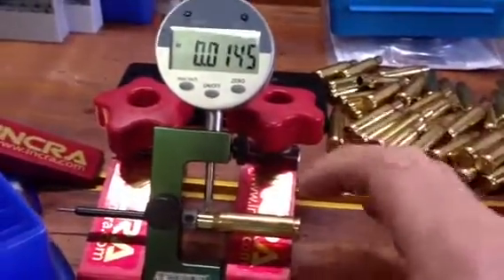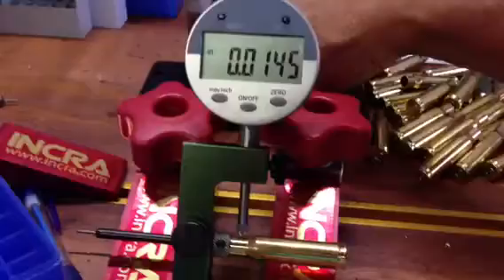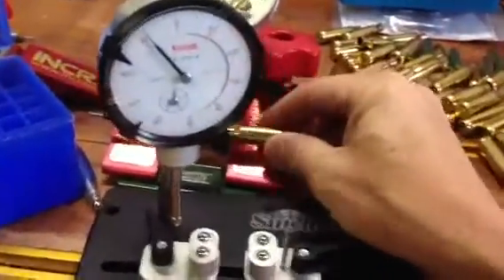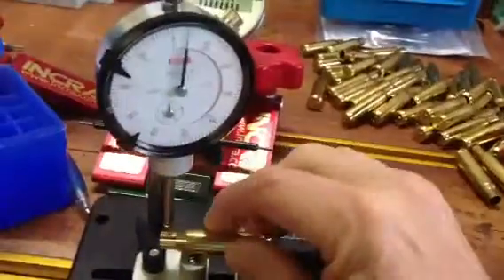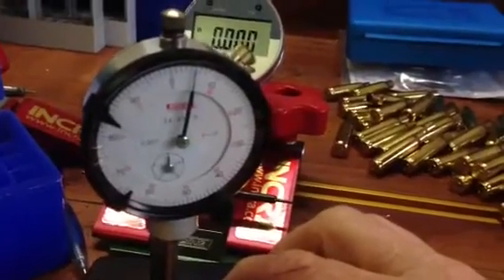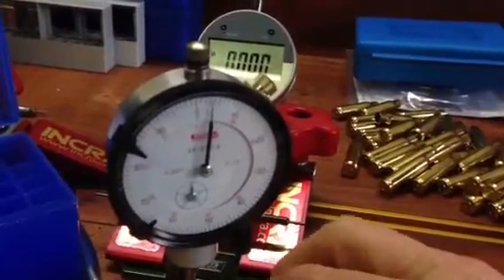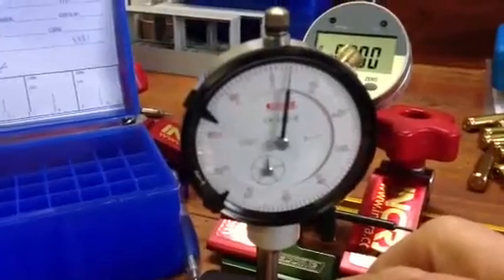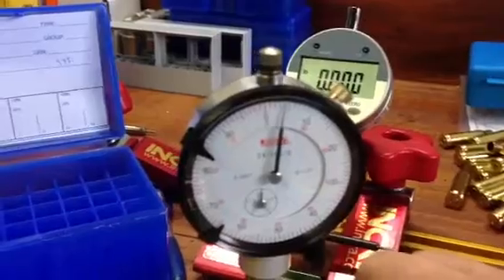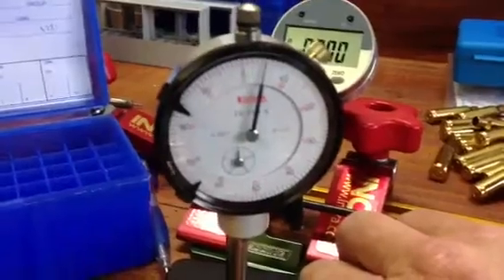Now this gauge measures thickness, and again, for the bushing I'm going to use, what I'll next need to do is put it on a concentric gauge like this one here. I would use the same digital piece normally. But as you can see, this is really sensitive to how I touch it and turn it. This is for runout now. And I'm getting — if I use this correctly — about one thou of runout if I position my hands correctly.